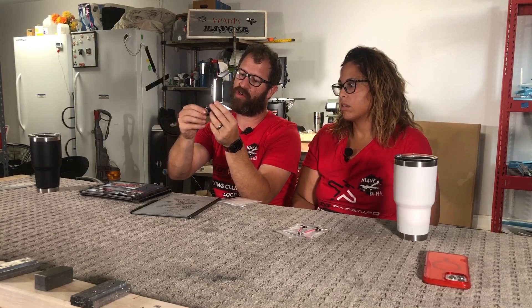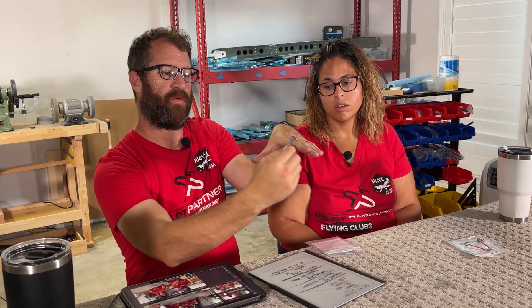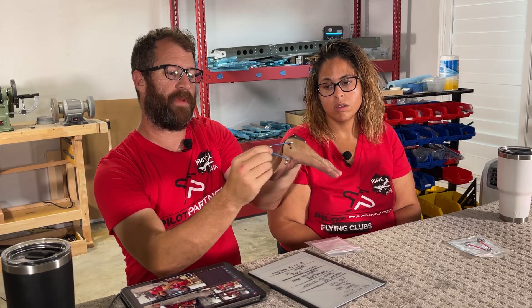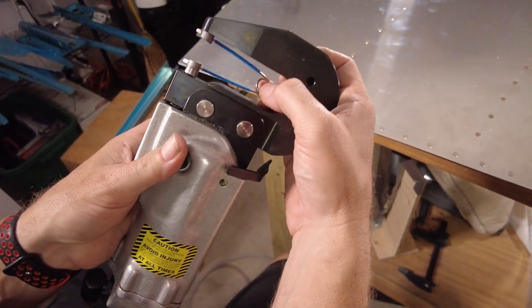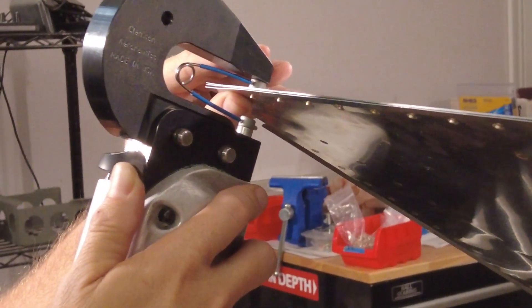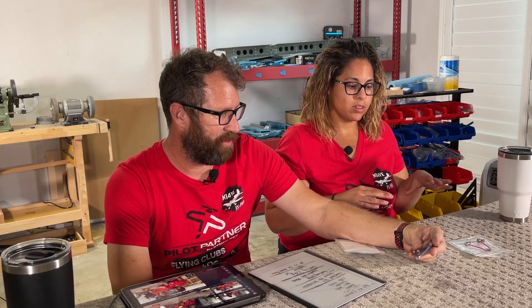The trick is to make sure, if the trailing edges go in here, that you keep this perpendicular. You don't want to hit it at an angle, because these are calibrated to go right at this specific angle. It did some really beautiful double flush rivets — I'm really happy with them. I almost can't tell which side was the shop head and which was the manufactured head after these.